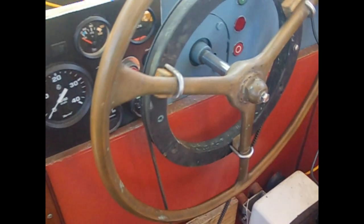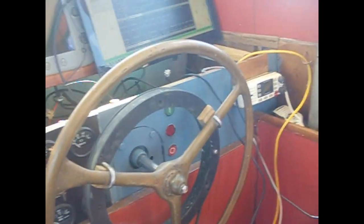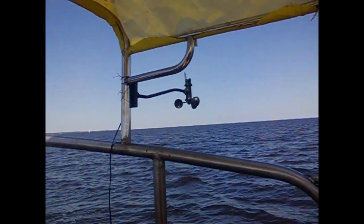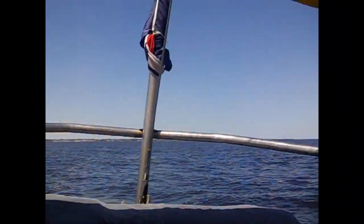I am only using the Davis anemometer, which produces an analog voltage for wind direction and a pulse for each rotation of the cups. The anemometer is connected directly to my weather sensors based on Arduino, which output NMEA wind speed and direction to the autopilot and OpenCPN.